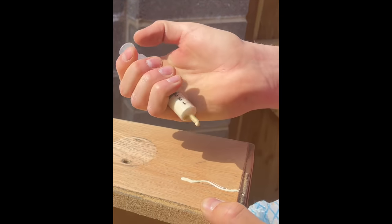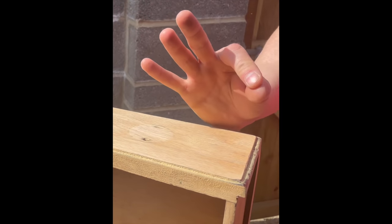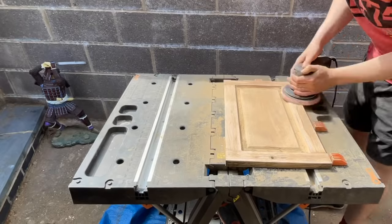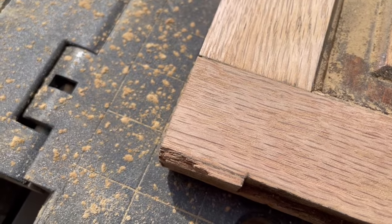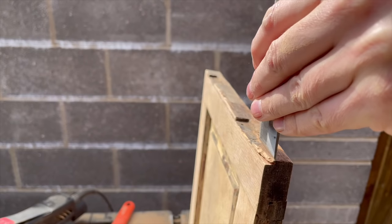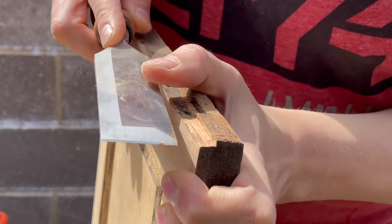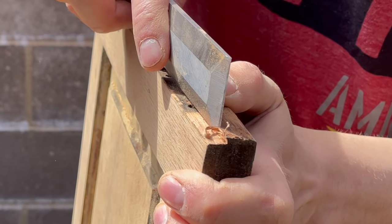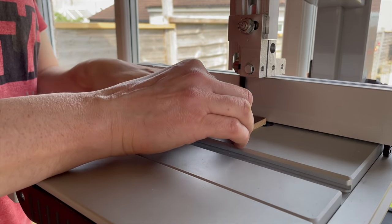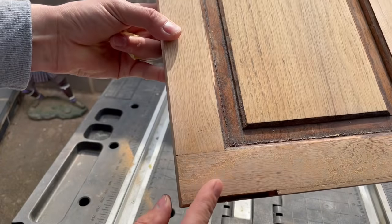This is the quickest method to fix small or narrow cracks in the wood — just use some wood glue and go over it with a sander. As I was sanding the doors I noticed another piece of wood missing so I repaired it. If I wanted to paint this piece of furniture I could have easily used wood filler, but this is the proper way to do it. I think I'm also going to keep this piece for myself. After gluing and sanding you can hardly tell there was a repair.